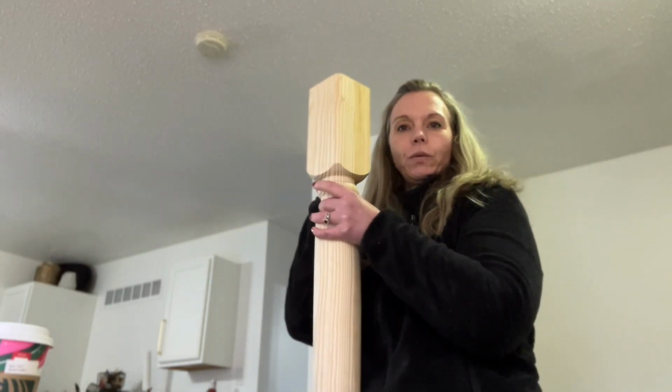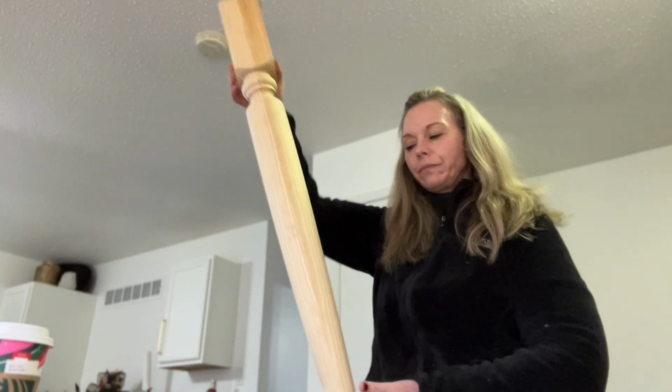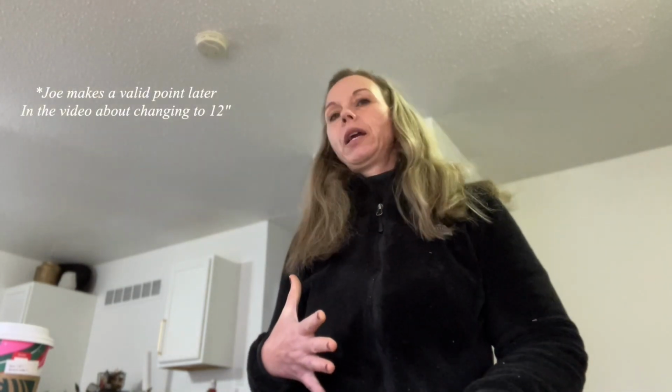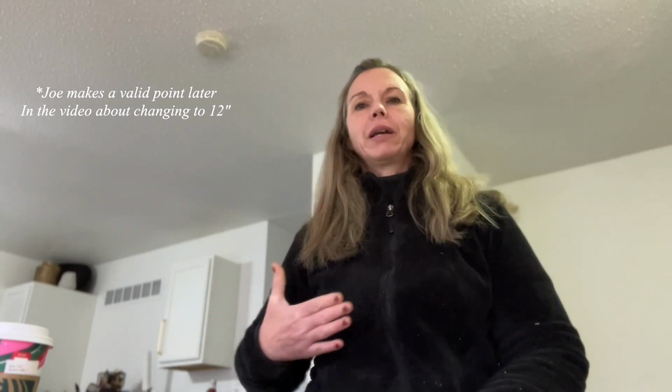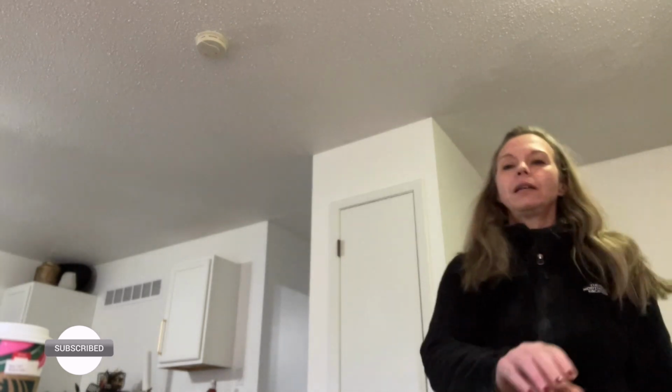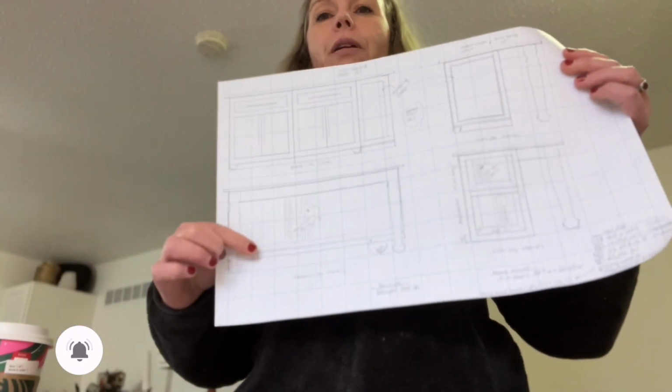So 2 of these in this profile will come out here 15 inches. Everything that I've investigated, they said 12 is traditional, but 15 is a generous overhang, just depending on the height of people, because their hip to knee ratio is different. So 15 is generous. 15 will accommodate most everyone. And so we're going to do that 15-inch overhang.